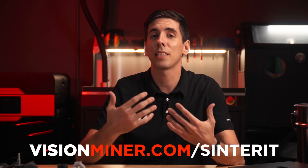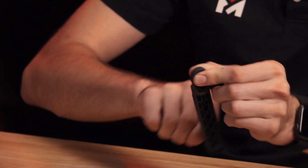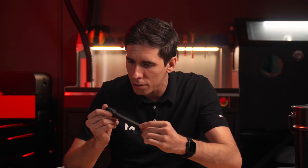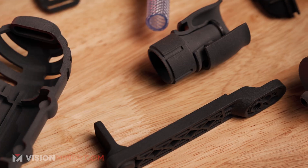Let's check out some example parts. I have this excellent example part in my hands right now — it's basically a handle that you would put on something and turn. This was printed in one part, probably in this orientation. Generally, you want to print circles facing straight up to get the best accuracy and tolerances. It's some sort of bracket type thing. Let's dive into some photos for more ideas on what you could use this material for.